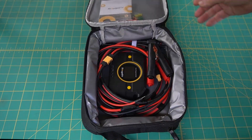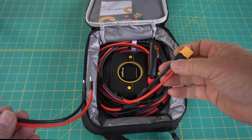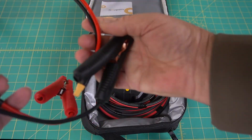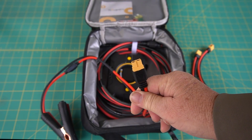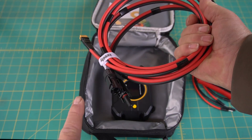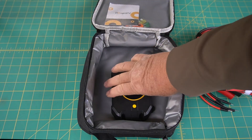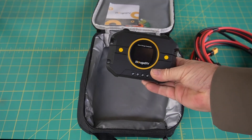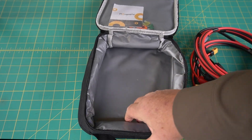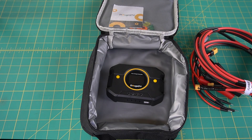Here is how everything is packed in the bag. The cables I made up will hook to the Bougerv controller. This other one I purchased but put the end on it myself. This end here — the XT60 — is for the solar. Most of my solar panels have this connection, so I put the XT60 on that end, and the other end goes to the Bougerv. This is a PWM controller and it's actually padded — kind of an insulated deal. Let me show you each part individually.